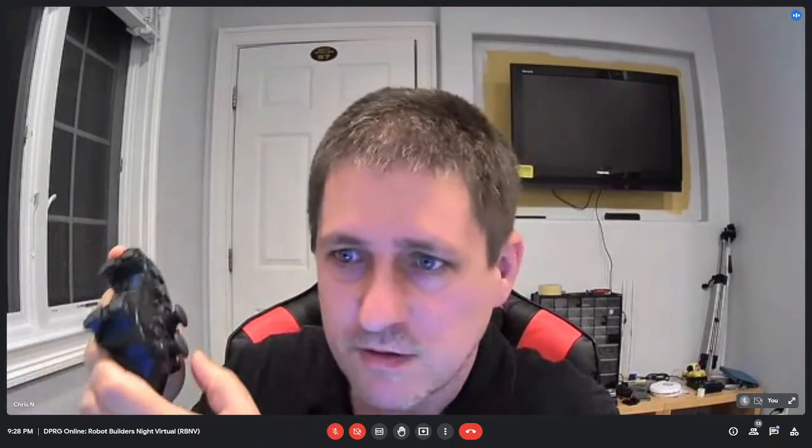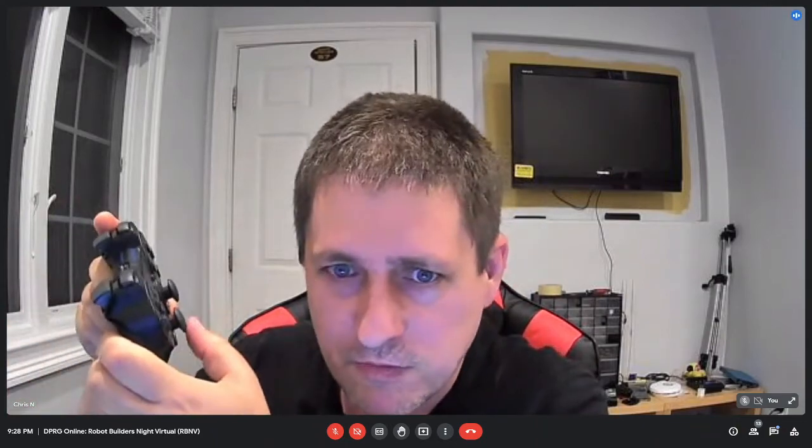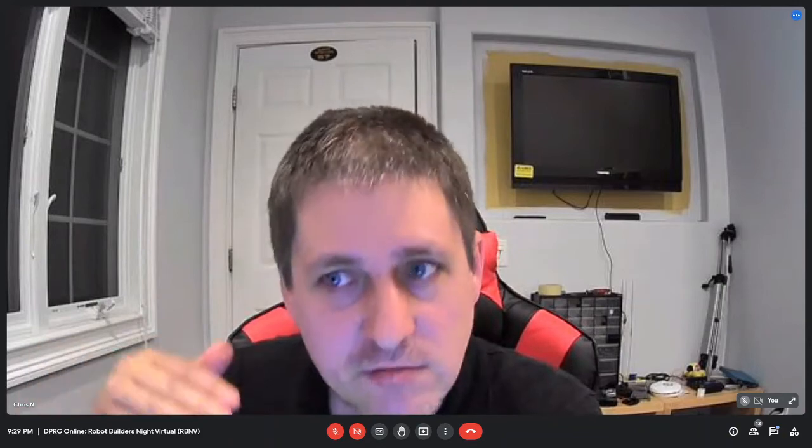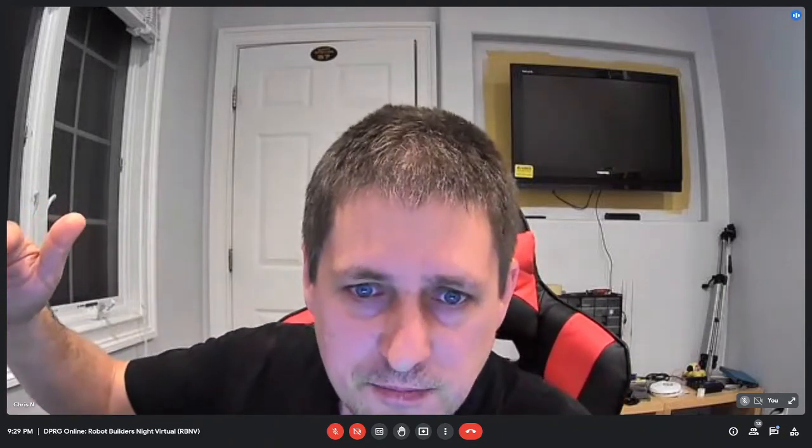which makes me want to try this per behavior slew rate. So my use case, a much simpler one, because let's say just two behaviors. Behavior one is user input. Okay, got my joystick here. So I give it a speed command, right? I can step on it, so to speak, go from 0 to max speed instantaneously. As a user, I can do whatever I want, but I don't necessarily want the robot to immediately output full power to the wheels. It'll be very jerky movement, right? So I have a slew rate controller where even if I go from 0 to full speed, it just will ramp up to full speed at the defined slew rate.